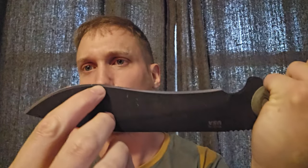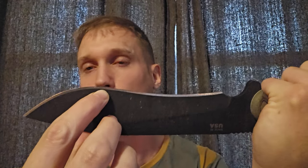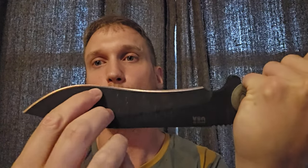To make this really plain: if you were to measure the thickness of the edge behind the micro bevel — this shiny part here is the micro bevel — if you were to measure how thick it is behind that shiny part at the top of it, which would be the shoulder of the micro bevel, that is your behind the edge thickness.